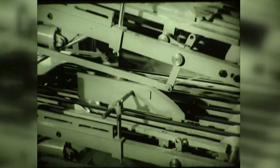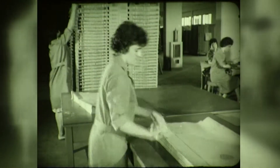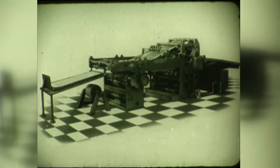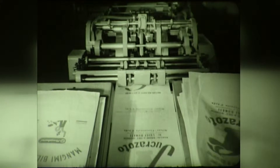The completed stacks are then ejected automatically. This is the manufacturing process of tubes for valve sacks with stepped end pasted bottoms. By cutting out the perforating unit and engaging a cut-off aggregate instead, straight cut tubes as well as satchel tubes for sacks with sewn closures can be produced on this machine. Tubes produced on tubing machines of the 501 and 510 types can be further processed on the single-ended block bottoming machine, type 561, if a bottom is to be formed at one end of the tube only.